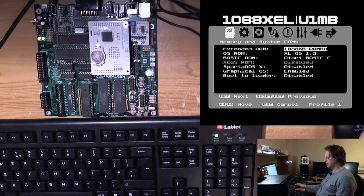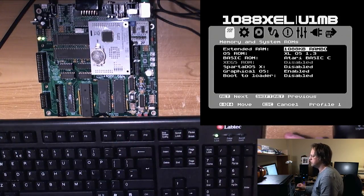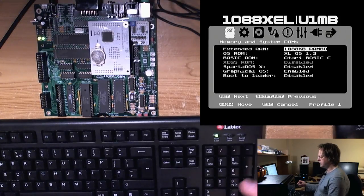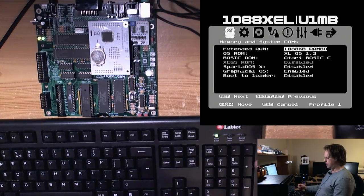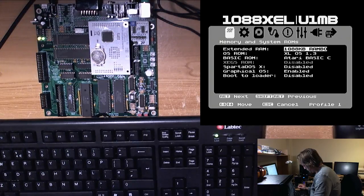Funny you should mention a single key taking you to the loader, because way back about 2 years ago when I was writing this initially, ProWizard and I were talking about something along those lines. Eventually I ditched it because we mutually agreed it was potentially destructive. You can get into setup non-destructively and come back to where you were before, providing you've got reset protection in your program. But if you start the loader from the setup screen, obviously it's going to reboot the whole OS. The fact that you've implemented it outside of the firmware is fine, it's a nice extra. I just didn't do it in the firmware.